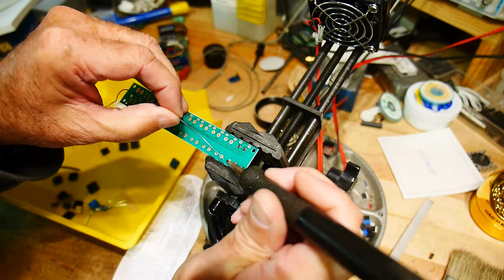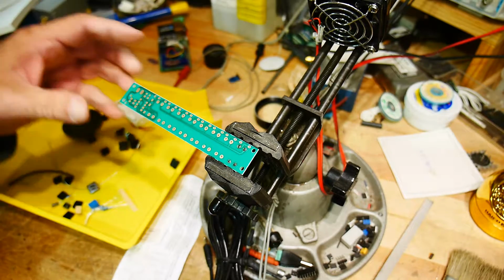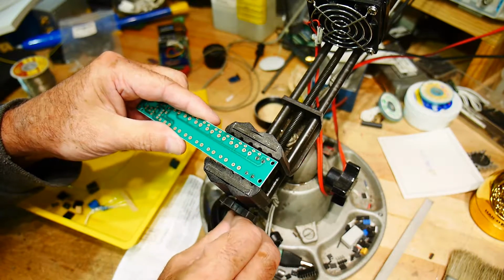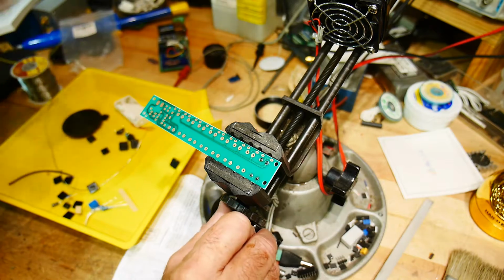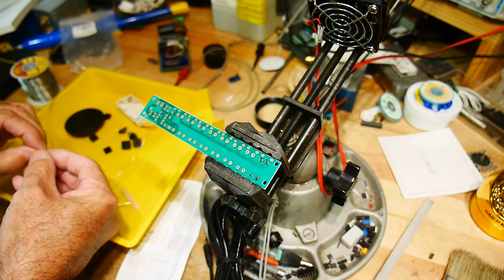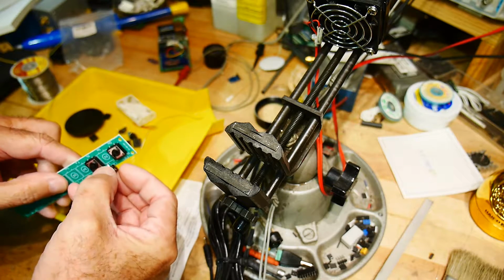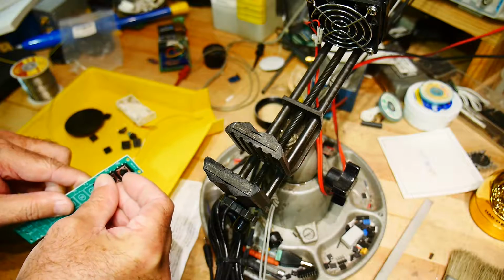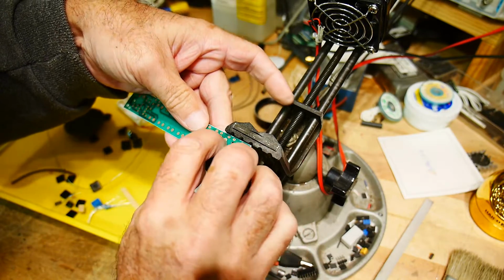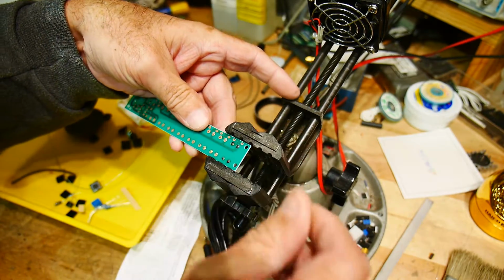Yeah, PC board is interesting. It has a solder mask. It has bare copper though, and it is only one-sided, so it's not the cheapest PC board. It's actually pretty good quality for a single-sided board. A lot of times you'll see them made out of kind of a phenolic, kind of a wood and paper type of construction. Quite brittle, but this one seems like actually FR4 material or something like that, at least some type of fiberglass. Let me bend these pins so they don't fall out. Oh, they are falling out. Oh, there we go.